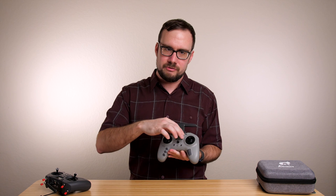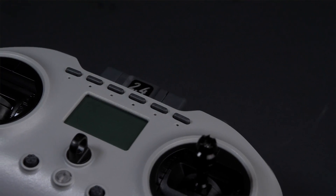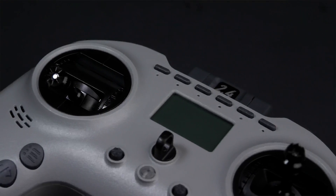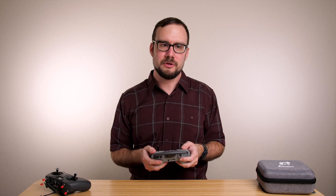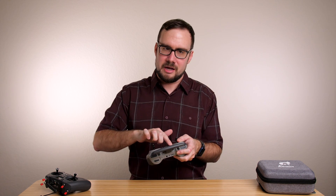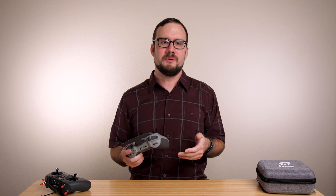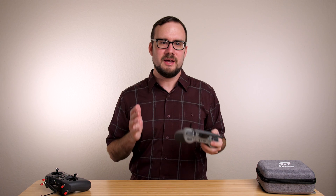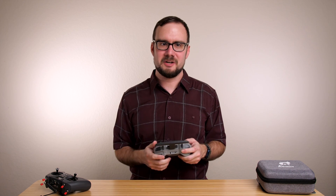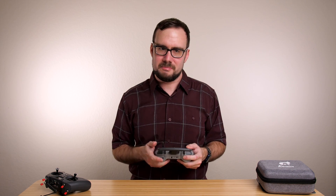The last flight control I want to mention is this series of six buttons on the front of the radio near the top. This is something we haven't really seen before on a radio this small — the T-Lite didn't have it, and it kind of reminds me of a similar set of buttons on bigger radios like the RadioMaster TX16. It's an interesting control to add and could have some pretty cool uses, but it's not set up very well out of the box. It's clearly designed so only one button would be active at a time — there's a little LED above each one — but the radio isn't set up to send all of that information on a single channel, so it'd be hard to actually use with your flight controller out of the box. It's easy to fix in EdgeTX, but again, I don't know why Jumper didn't set it up that way from the factory.